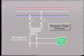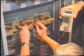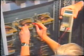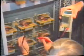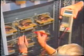Another potential hazard involves work around potential or voltage transformers, even when disconnected. When the low voltage side is energized from test equipment, the high voltage side will provide a very high voltage across its terminals. On other occasions, when performing troubleshooting tests on an energized VT or PT, remember never to short circuit the secondary winding — this can prove disastrous to you as well as to the transformer.